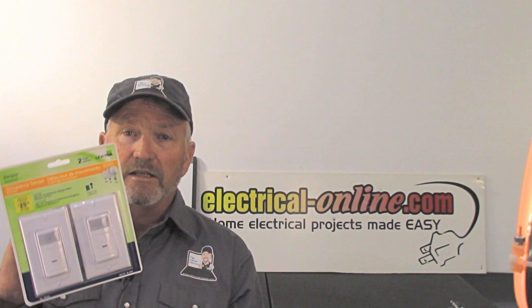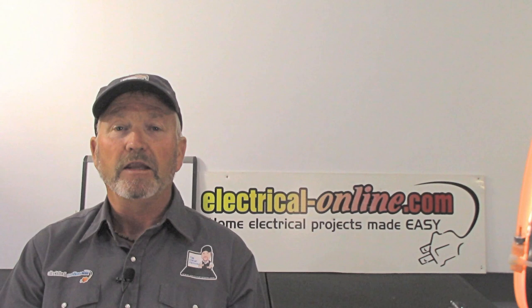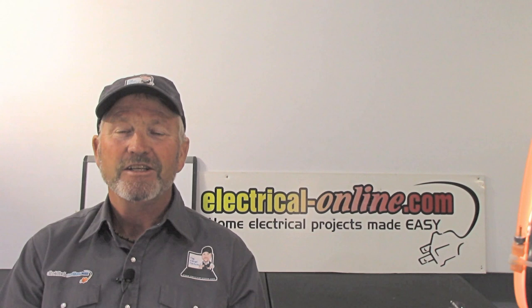So the solution: I'm going to put in an occupancy sensor. These are occupancy sensors I found at Home Depot — they're a Decora occupancy sensor auto-on from Leviton; a two-pack was a good deal. They are just single pole occupancy sensors, so I'm going to install one on the under cabinet lighting so they're on whenever we're in the kitchen. However, if there's no motion in the kitchen they're going to shut off, so I can just head off to bed, turn on the hall light, and knowing full well the kitchen under cabinet lights will shut off on their own.